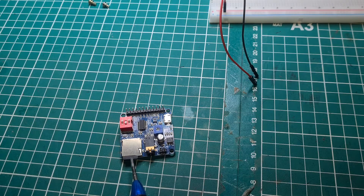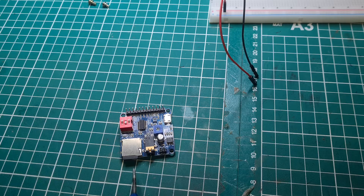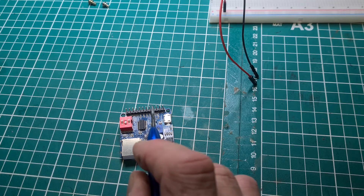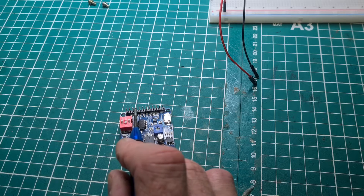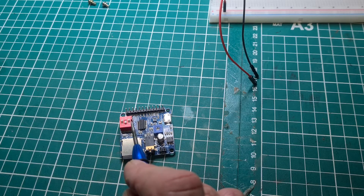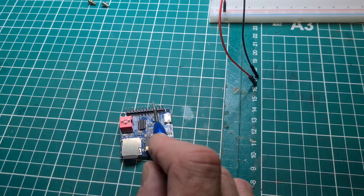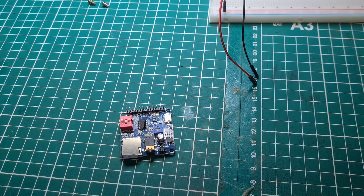All your sounds are on your SD card. When you use the SD card you can store eight different sound effects on it, but they all have to start with four zeros and then one, two, three, down to eight. That corresponds with one of the eight pins along here. That's your busy pin so you can operate one of your props via that, and that's the ground pin. When you've got the ground pin connected and touch one of these pins, it'll pick that sound and play it for you. That's your volume, and you can also connect PC speakers to it as well.